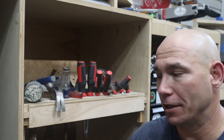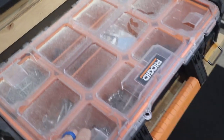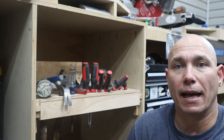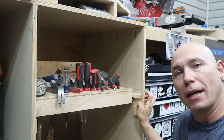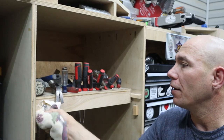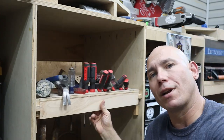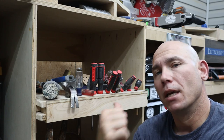This is my junk drawer that I made — I ran out of slides when I was making my miter stand, so I made my own drawer slide. I took a piece of three-quarter inch by three-quarter inch board strip and nailed it to my miter stand, then put two more on the drawer and it makes it slide. You really want them to glide smooth. I smeared paste wax all over these slides — especially the one mounted to the miter stand — and it makes the drawer glide a lot smoother. So if you've got wood on wood and need it to glide like a drawer slide, paste wax is good for that.